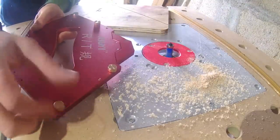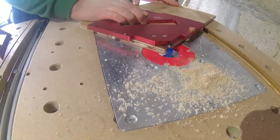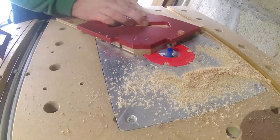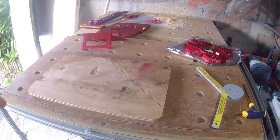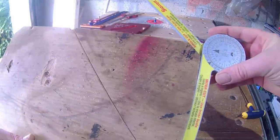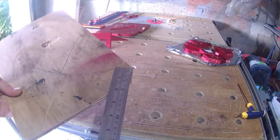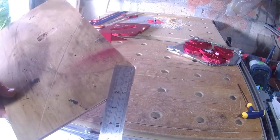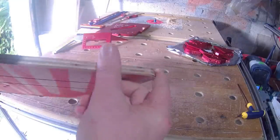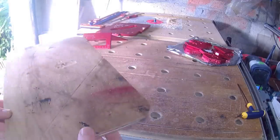Although you can have two different templates attached, you need the thumbscrews in different positions for each template. For quick swap over you could use four above and four below, but of course I'm one short so I just have to move them around. The results are as you would expect — round or profiled corners. I used the T20 on the profiled or cut-off corners; the angle on all of them is 45 degrees and the length of the cut off from the T20 is 35mm. No idea what the relevance of the 20 is, but I really like these tools — they're useful for adding interest to corners in your unit or cabinet builds with accuracy.